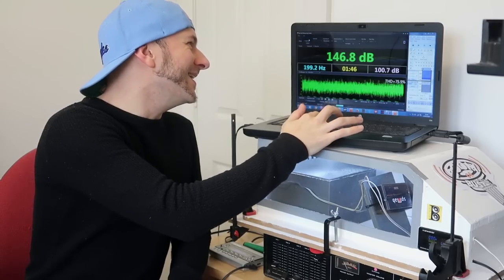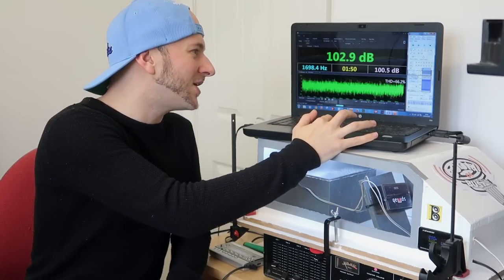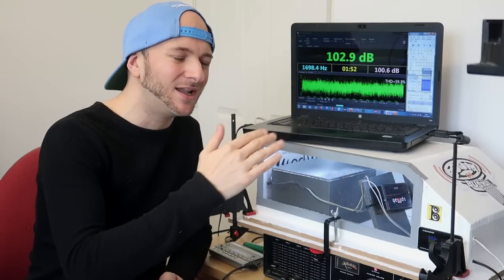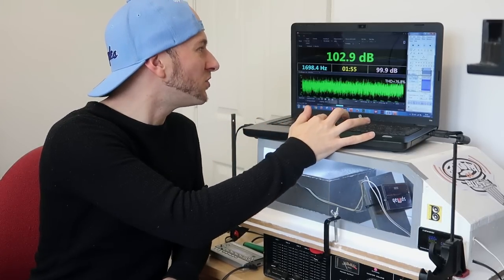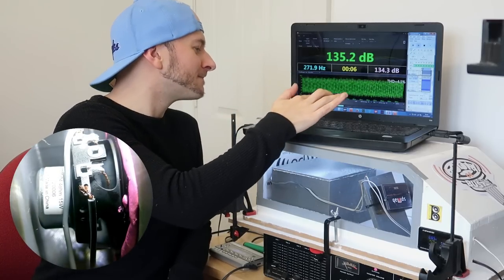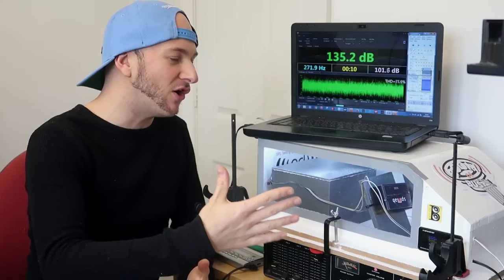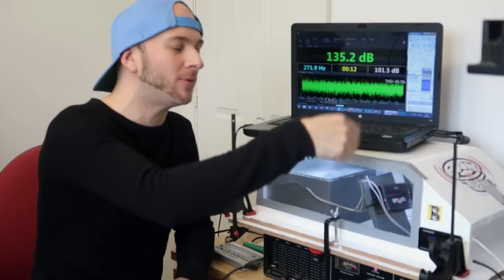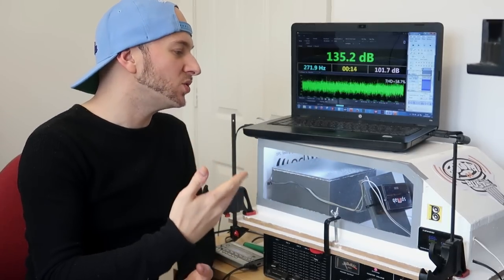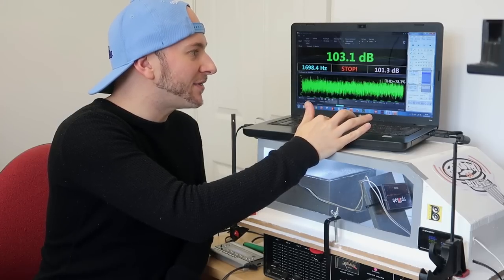Now, surely it can't keep this up with the higher frequencies. Let's do 45 scaled hertz next. This is the one where the sine wave is a bit slanty. I don't know if that's going to affect the score at all, but let's see. Okay, yeah, so it's still quite loud, but it is well outside of both the quarter wave mode and Helmholtz mode of this cabin now, and also not the most efficient frequencies this horn wants to play anyway. A 135.2, still really impressive. Now lastly, 60 scaled, which is a 360.